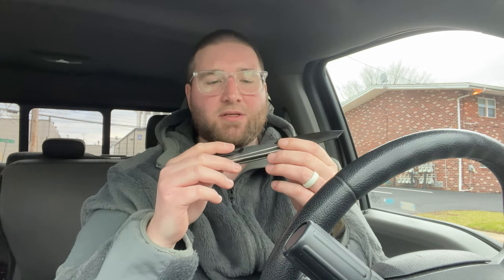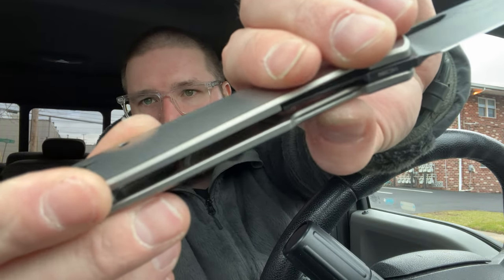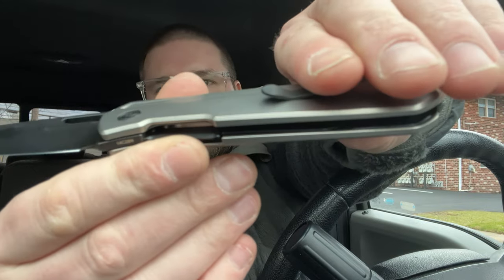My other little nitpick is the acoustic — it's really good on the open, really nice. But when it closes, you do get a little bit of a ting, a zing. I don't know if I love that, but that was how the prototypes were and there's really nothing we can do other than not mill the handles. We had a version with a longer backspacer that had the same sound, so it wasn't the backspacer. You can see it is heavily milled out in there, and that is part of the reason — you have that steel liner sitting in a pocket with heavy milling, and that's just gonna reverberate differently.